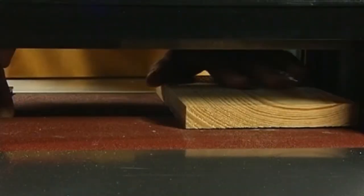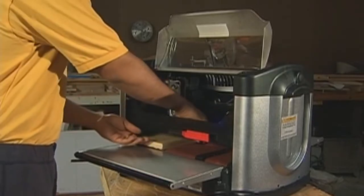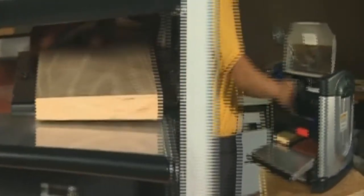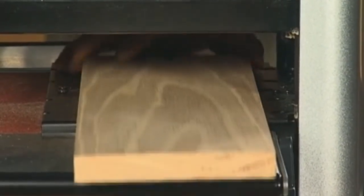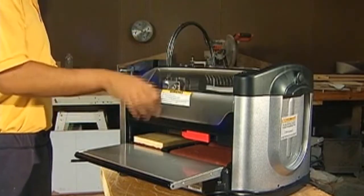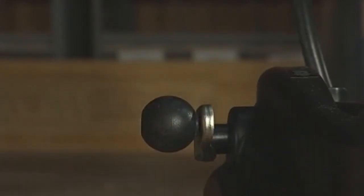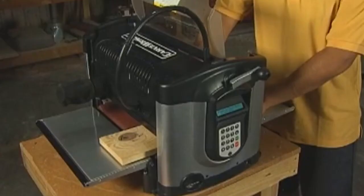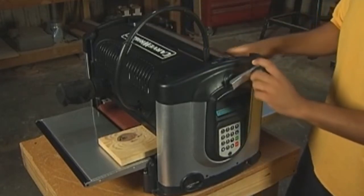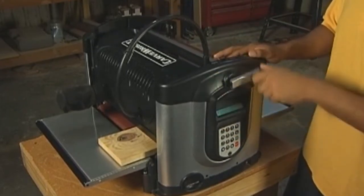Move the sliding guide plate up against the right edge of the workpiece. The sliding guide plate is used to guide the workpiece and is not intended to lock the piece in position. It is critical to ensure the workpiece can travel freely in and out of the machine along its entire length without getting wedged. Test the workpiece by moving it in and out of the machine by hand while it is lying flat on the traction drive. Next, lower the head by turning the head crank handle counter-clockwise. Once the correct pressure loading of the head is reached, the clutch will begin to click. Continue to rotate the crank two full turns once the clicking sound is heard to ensure full loading.